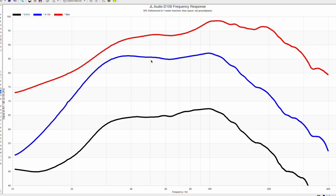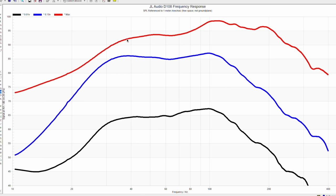When I maxed out the volume to find the maximum SPL capability, the red line shows the frequency response. Instead of just cutting off the low end, it also cuts off below about 80 Hz — that area is no longer flat, it trends down and then drops off more. It does some different things in terms of frequency response than I would expect. In some of my other tests of similar-size subwoofers, they may not cut so much of the 80 Hz region — they might cut around 50 or 40 Hz, but with a super steep rolloff at the highest output volume. The JL doesn't appear to be doing that.